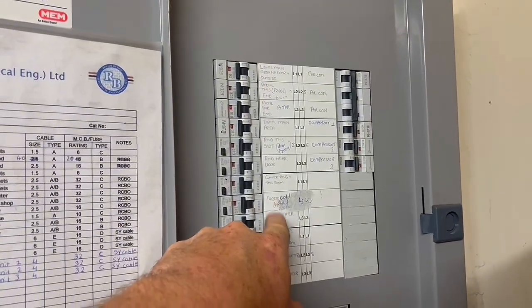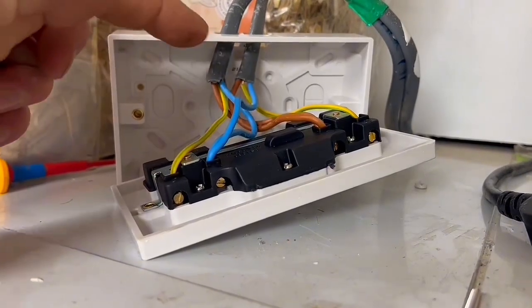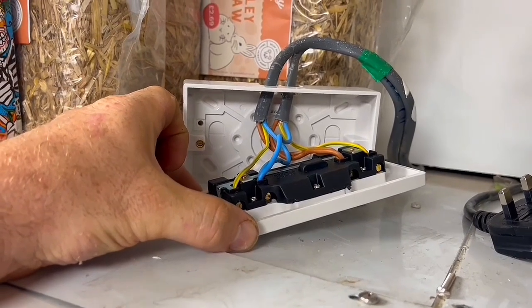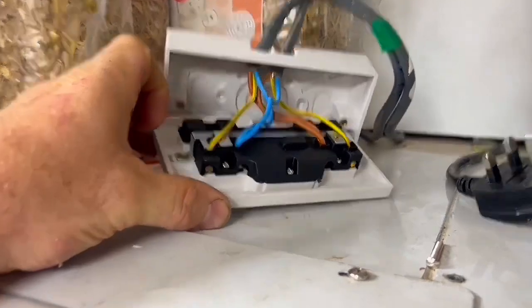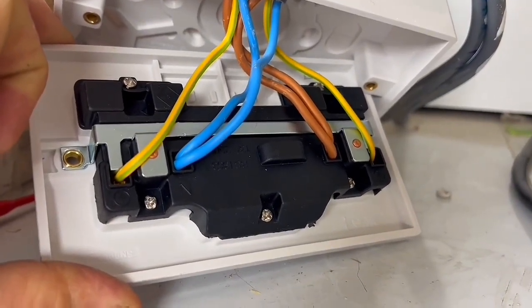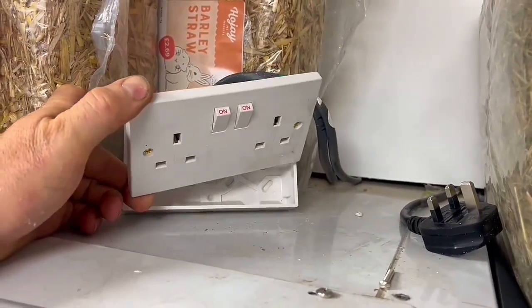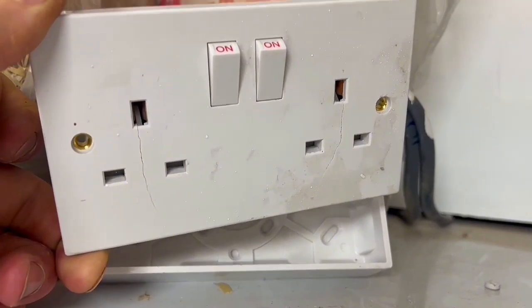The board is here and looking at the cables, just checking the connections — they all look quite tight. What I'm going to do is take the wires out of the terminals, just check them and make sure everything's okay. Looking in there quite deep, the insulation goes in quite a long way and I'm just wondering whether the screw is actually screwing onto the insulation and maybe not connecting. However, as you look on the front of the socket you can see that it's cracked.